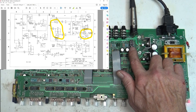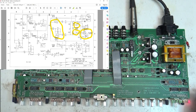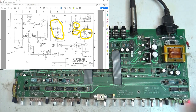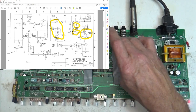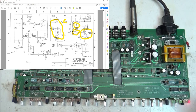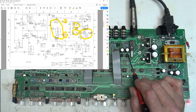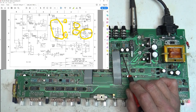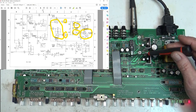Then I had nothing on the switch that selects between line level out and mic level out — the signal just disappeared. I started tracing it down. The capacitors had been changed, so that probably wasn't it. There are little greenies in here and they checked good. Then I noticed Q2 and Q3.